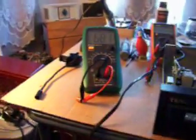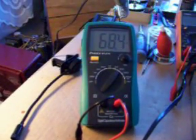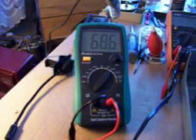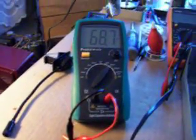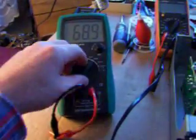This capacitor is very leaky. It won't even read 75 microfarads anymore. It's made as high as 70 and it dropped back down to 64. That's supposed to be a 100 microfarad capacitor — that one's pretty well toasted. But all in all, the meter does do a good job.